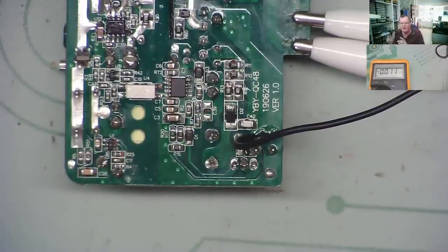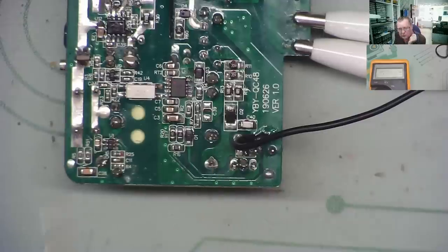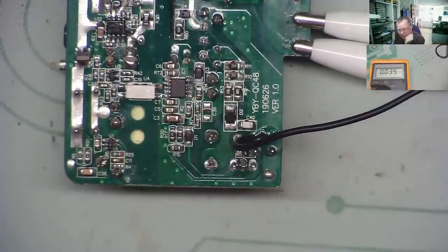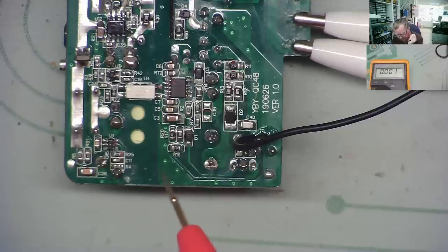Well, the light bulb flicked on, so I know there's power gone in. So we can have a look. This is 320 volts. What's on pin 9? 200 volts, so that has got high power on it, okay? What's on the VCC? That's here. 20 volts, okay. This chip has power. I've switched it off for the moment. What's happening to the high voltage?